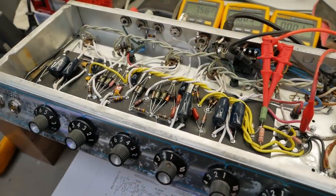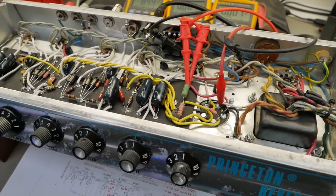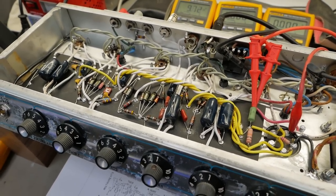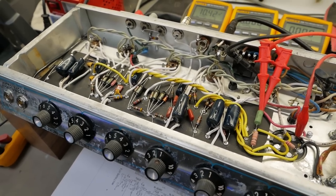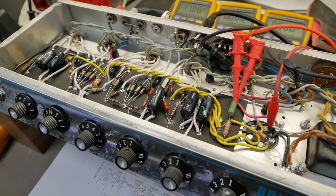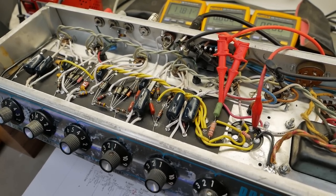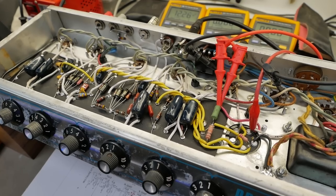Normally I've got nothing but love for anything from WGS, but I'm not a big fan of that Fat Jimmy. There's a lot of bottom end and a real raspy top end. Don't know. What I might do is we'll do the couple of voicing changes we were going to do anyway, because I feel that this amp pumps a bit too much low end into that little cabinet and little speaker. And we'll see if it's a little bit more graceful after that. And it's a taste thing as well. Back the treble off a little bit, you're probably all right. We could put some slight treble cut after the phase inverter, however, that's another option.